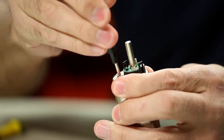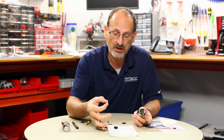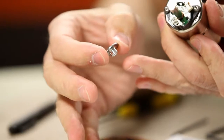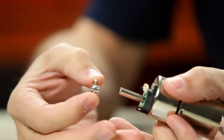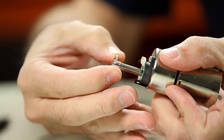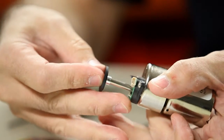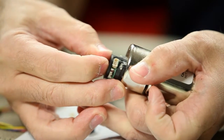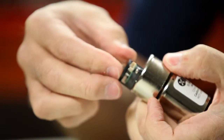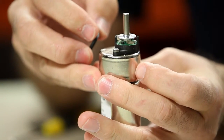Once you get both sides, snug them down good — it doesn't have to be real tight. Now, this next part is important. If you look at this encoder, there are two distinct sides. The tall side is going to go onto the shaft first. Then included in this pack is a special spacing tool. Get that started, then you can put the cap on top and slowly press that down. That spacing tool will bottom out against the two tabs on the side of the mounting deck. When you have that in place, you know your encoder is positioned properly.